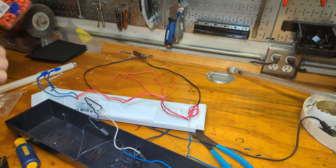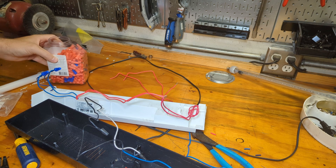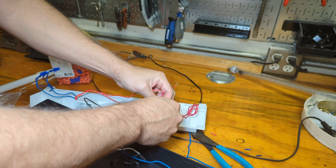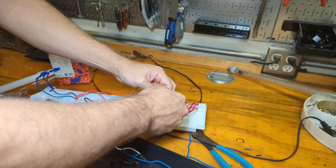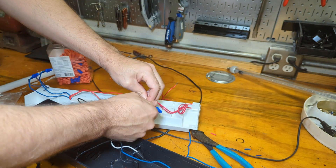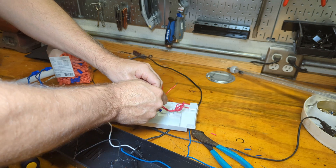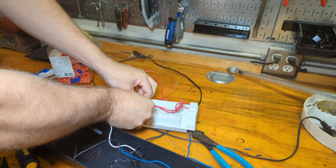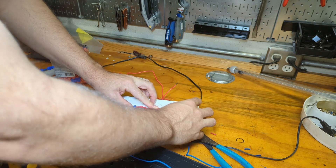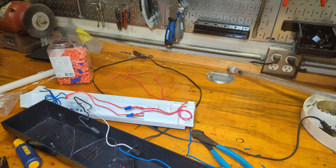You can replace the tombstones as well if they're all burnt up, though there are different styles — that's out of scope for this video. And the color of the wire nut doesn't matter here; it's okay to use a blue wire nut with red wire. We'll just fold our wire in here nicely and give the fixture a little bit of compressed air before putting it back together.